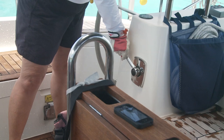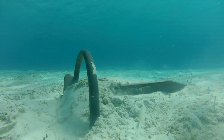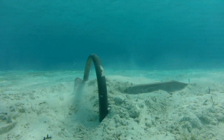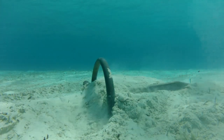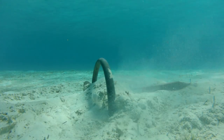If you have a powerboat with powerful motors then use a lot less. Note the anchor is still setting here but it's only moving a few inches as it buries deeper. When you're at the helm you will find it difficult to tell that something is happening. Remember this is an important step as you want to know the anchor has set deeply. Let it set for at least 30 seconds at strong thrust so you are sure it has set well.